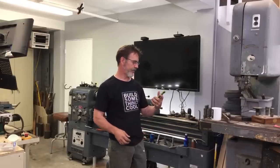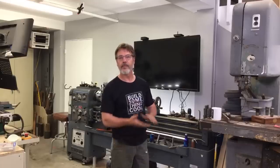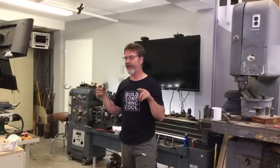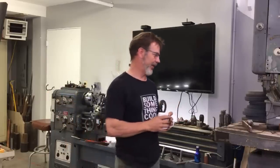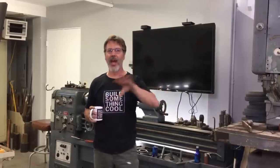Somebody wants to know if you will be running a rotary phase converter or if you have 3-phase available. I actually have 3-phase here. What's interesting is I have 3-phase with a wild leg. So usually with 3-phase you have 3 legs that come in that are 120 volts each, and that gives you 240 when you add it all up. I have it, the 3rd leg is wild, they call it, and actually it's 240, and I found that out the hard way because I burned up something that somebody had wired in wrong on a plug, and they actually wired in that wild leg into a 110, and I plugged something into it, and well, smoke came out of whatever I plugged into. So I found that out the hard way. I'd heard of it, I thought it was an antiquated system, but it's all been updated.